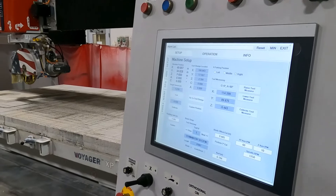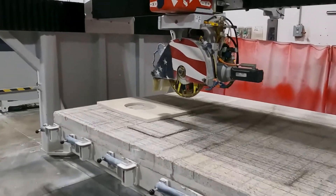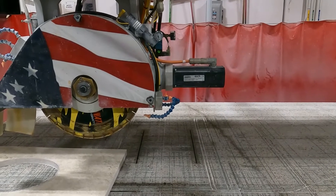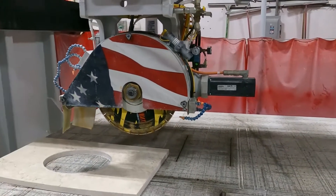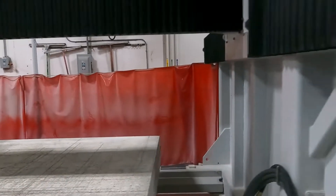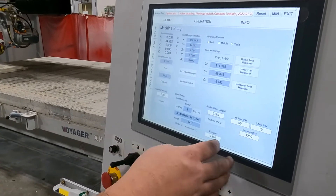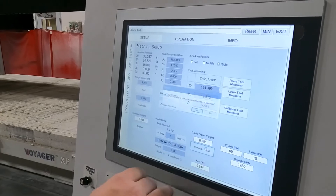What we're going to want to do is activate our pendant. We're going to come over here and look at where the approximate center of our blade is. It's going to make the first cut that way, and then cut the square out — so it's going to be a strip like this on the stone. Standing back, I can see that it goes over the stone. I always tell people: double check your water, make sure you have it on the correct one. Once we have everything where we need it, we're going to shut off the alarms and hit 'Perform One-Inch Test Cut.'